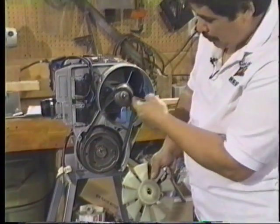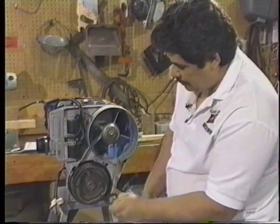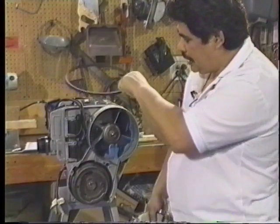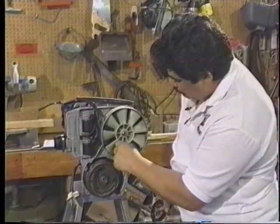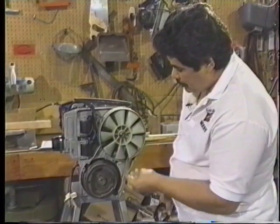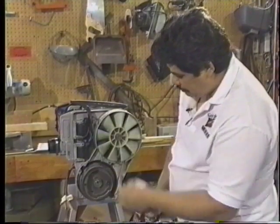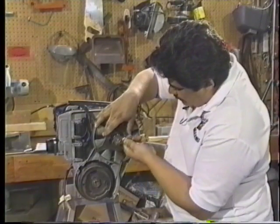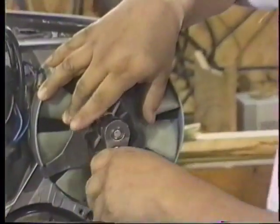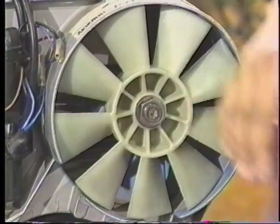In this instance we'll want to remove a washer and then reapply the belt. We don't want to torque the fan against the belt, so we will take the belt out of the way, put the fan back into place, and put our washer back on our nut. With our fixation tool again we will apply it and tighten the nut, and you will torque that to the specification in your operator's manual.